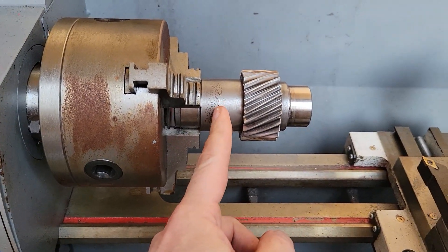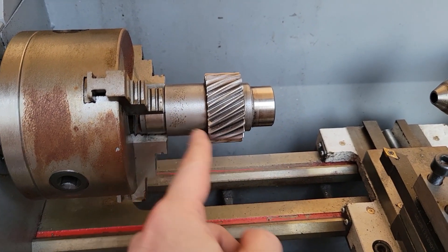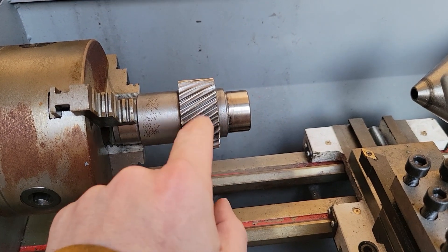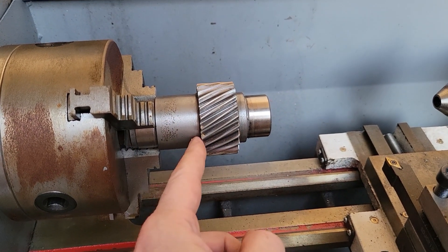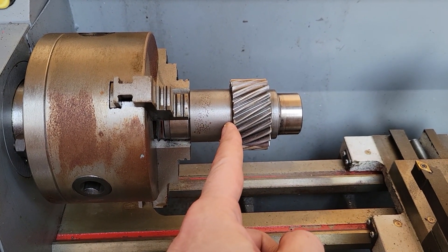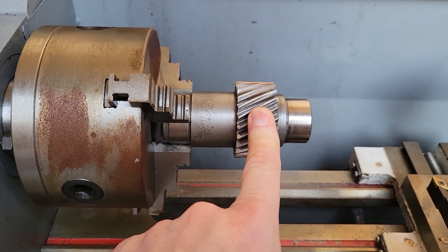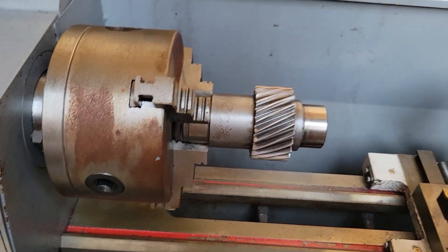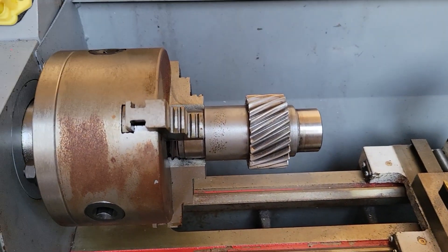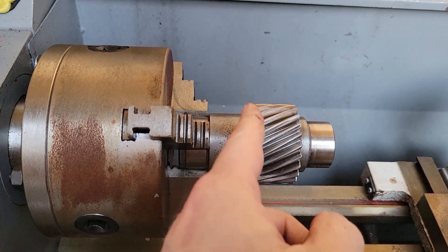The splines only go up to about here, so I'm actually going to cut this off here so that we can trim this down to fit inside a piece of tube. I could try and grind all this down but this is all going to be very hardened, so I figure just cut it off here and I've got a decent length piece that can sit inside our tube. First step, I'm going to get this spinning up at a slow speed in the lathe and chop it off there.